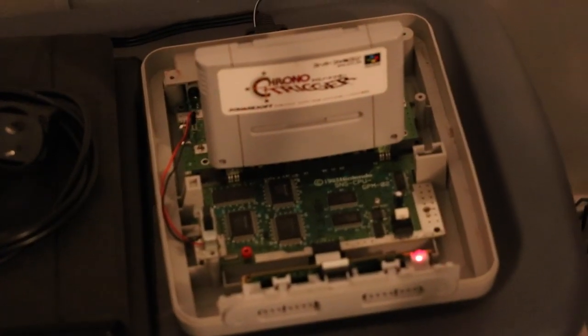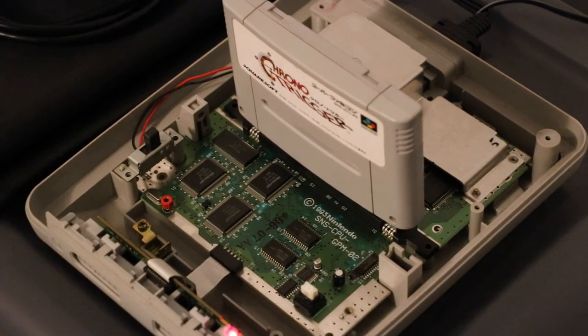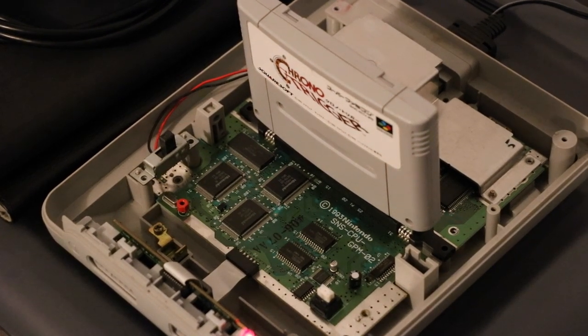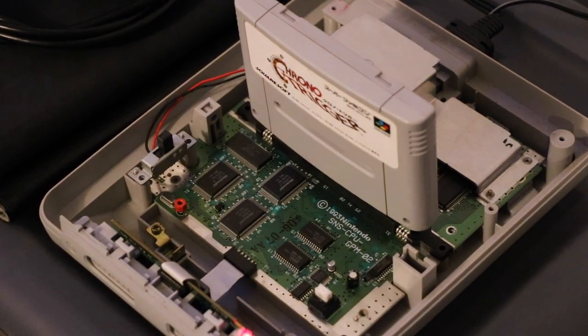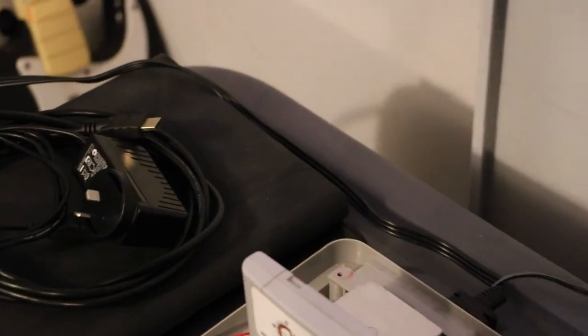Where are those things falling to? There's nothing down there. Oh well, next step is to clean the cartridge slot. Oh, that was the other thing that was interesting. When I reconnected it, I may have blown the fuse, because I haven't got any screws in holding the main board in. So if you are doing something like this, make sure you rejigger your screws. Otherwise, you're going to end up with no video. It's the last thing you want. Or no power.